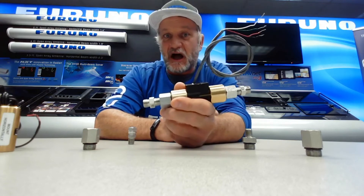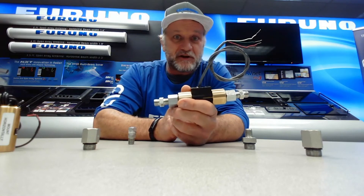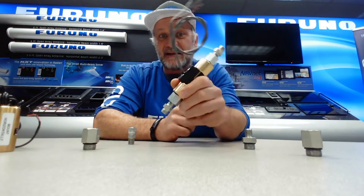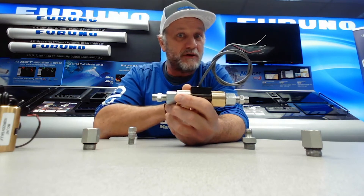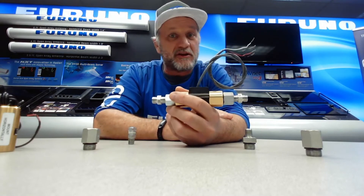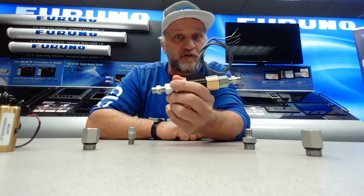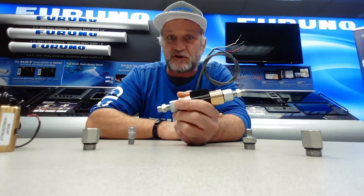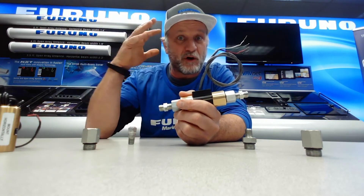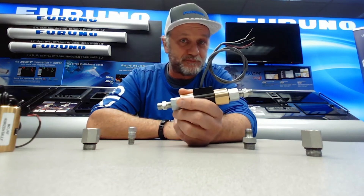SafeHelm 2 is in stock and will be released in early 2021, with a list price of less than $500 — probably around $450. You get all these components, easy installation, it's not position sensitive, provides no drag on the helm, and works with any reversing pump. If you're surveying a vessel with an existing autopilot from another manufacturer with an 80 or 160 series pump, NavPilot will drive those pumps perfectly. You can connect those reversing pumps right to the NavPilot 300, 700, or 711C output and also install the new SafeHelm 2 sensor.